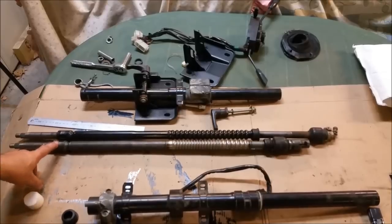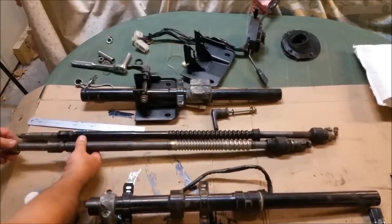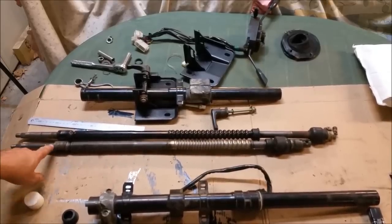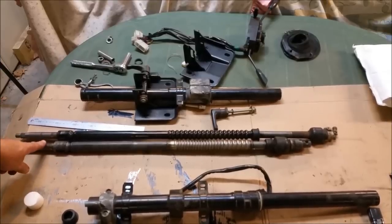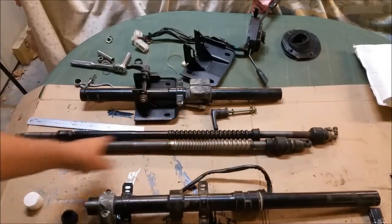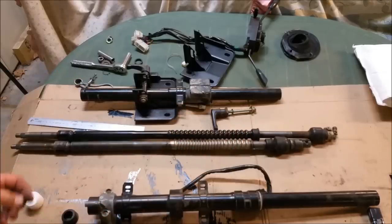The GK shaft is a third of a millimetre bigger in diameter - it's dirty, we can clean that up, but the bearing won't go over it. We could stick that in the lathe and hone it down with paper and water - I wouldn't try to cut it, it's hardened, and I wouldn't want heat getting into it. I don't want to take the uni off the other end, and if I have it on a through chuck it's going to whack around at the other end.